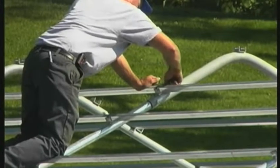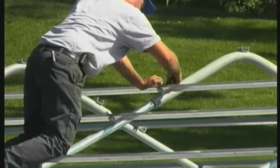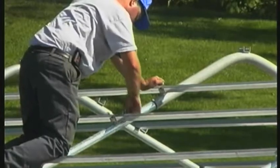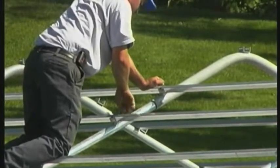Be sure to tighten all of the set screws of the bottom 3 slats before you climb on them. As you are climbing up to insert the other slats, you'll be standing on steel slats. It is important for your safety that you stand with your foot pressure straight down on the slat and do not push outwards or the slat might pop out.